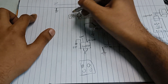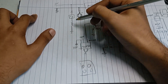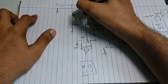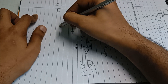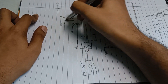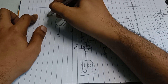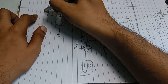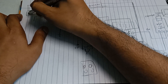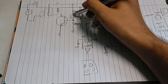The answer is the LDR. This LDR is connected through a 1K resistor to 5 volts and pulled down using a 4.7K resistor. A 1K resistor is used in series with the LDR, and the node is given to one transistor. We don't want maximum current when light falls on the LDR and its resistance drops to zero, as this would damage the transistor. So we use a series resistor. The negative goes to the collector, activating the relay, which will turn on our load — a lamp.